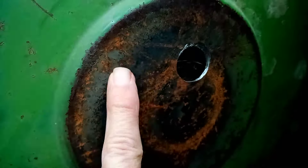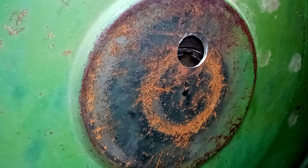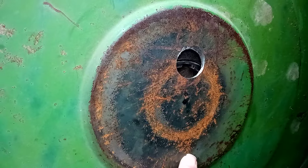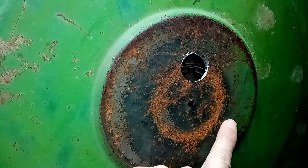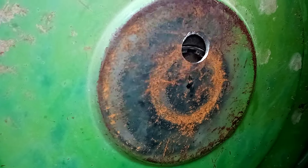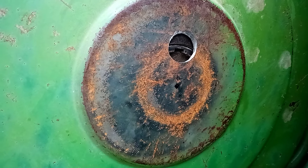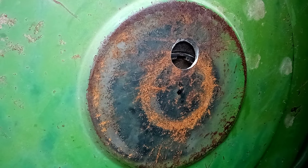I'm experimenting with spacers and shims behind the case. As you can see, that little space behind the shield has shimmed it out about a sixteenth of an inch, and that has provided enough clearance that the nut does not contact the outside. The original giveaway — this is before I had this tractor — you can see what the nut had done when that flywheel started falling off. It cooked this whole area of the cover so hot that the paint got cooked off. This is where a friend of mine touched it and burned his hand, and that's when I became aware that my flywheel was falling off.